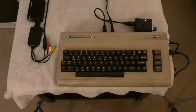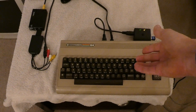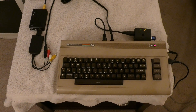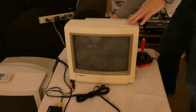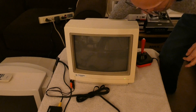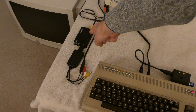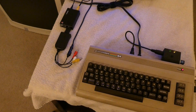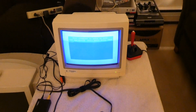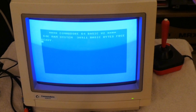Okay. So there we go, we have the Commodore 64 hooked up and we have everything running. I didn't hook up the 5 volts to that — my fault. But now we have — as I zoom in here — a color image from the PAL Commodore 64 to the NTSC monitor. You will see the black bars on the bottom and the top, because this monitor in PAL mode will show the screen slightly stretched, but you can manually adjust. You can see right here we're in NTSC mode, which makes sense because it's outputting an NTSC signal to this monitor.